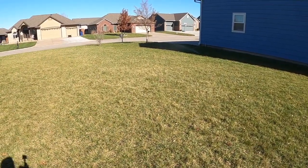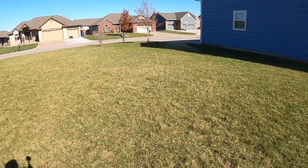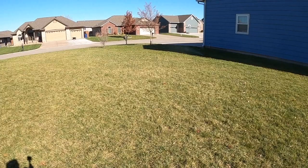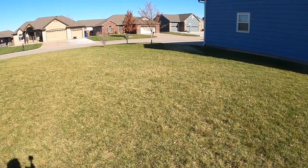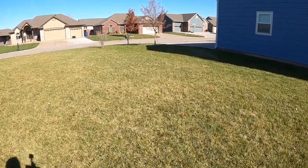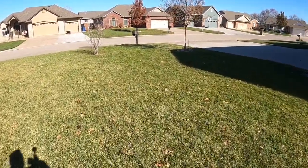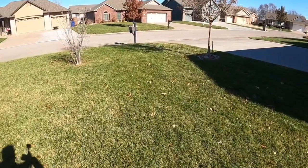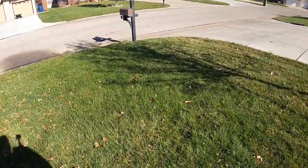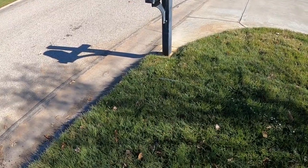Usually my zones are pretty big, so I will run it through a couple times, because as it starts blowing air, it loses pressure and doesn't have as much pressure to get the rest of the water out of the system. So each zone I'll cycle through twice. You can see maybe how these at the end, they're barely trickling. Okay, that one's good. This last one on the end of this zone. Still going.